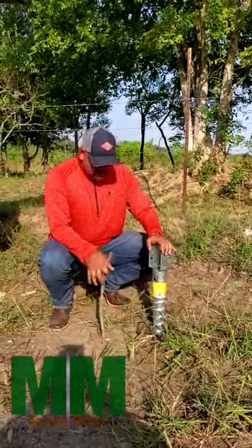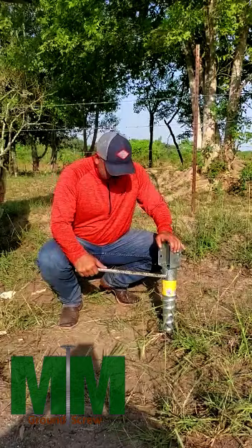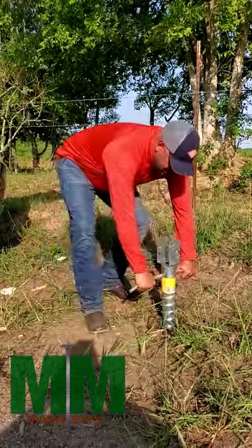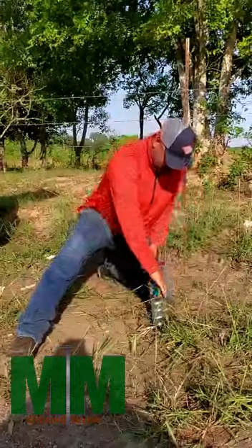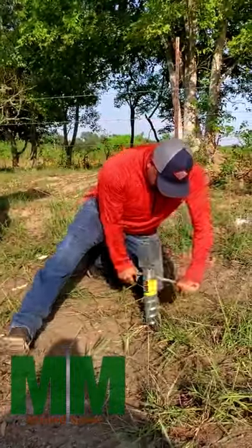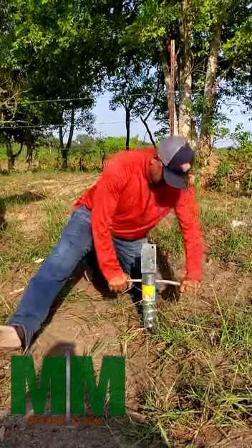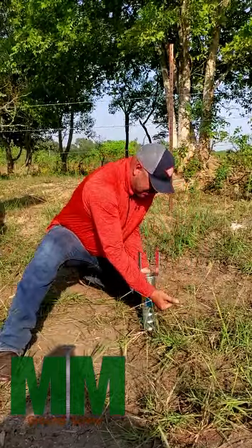We take our U-Type screw — every screw is going to come with a rebar included in the package. Simply slide it through the hole, use a little bit of force going down and then turn clockwise. As it starts to go down, you'll notice the tension gets harder and harder, and what that's doing is those screws grabbing a bite.